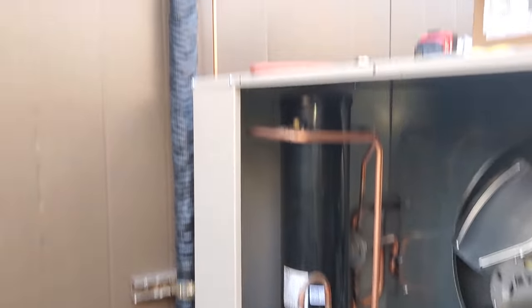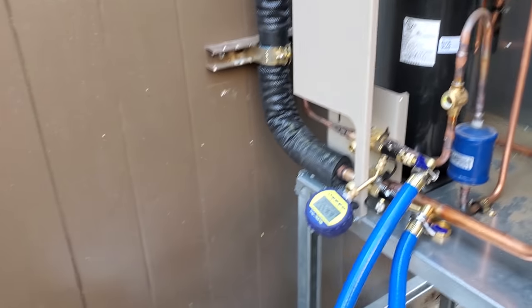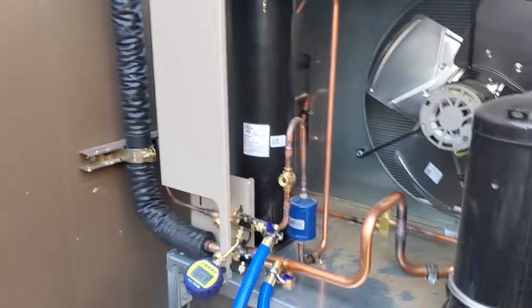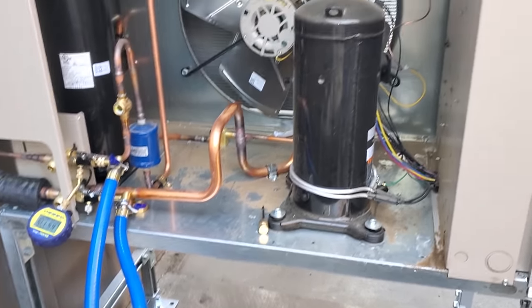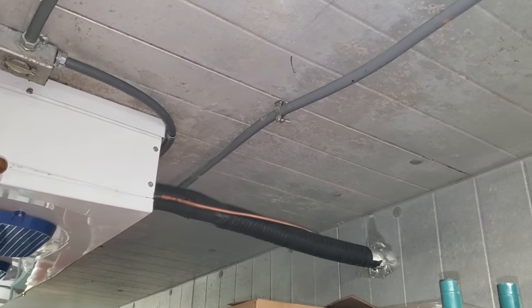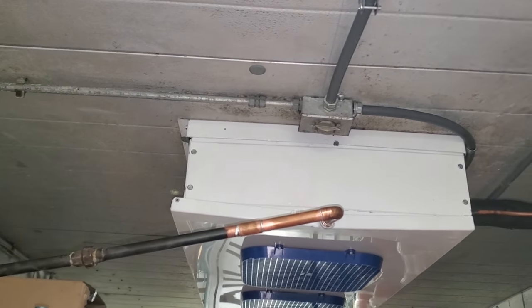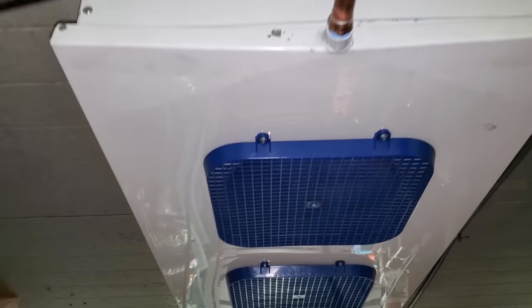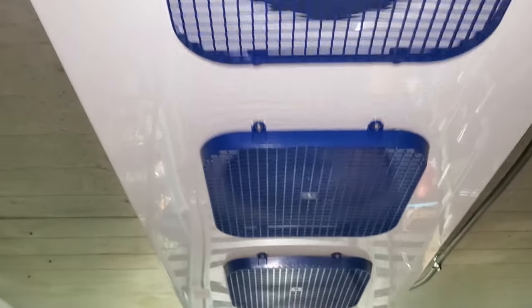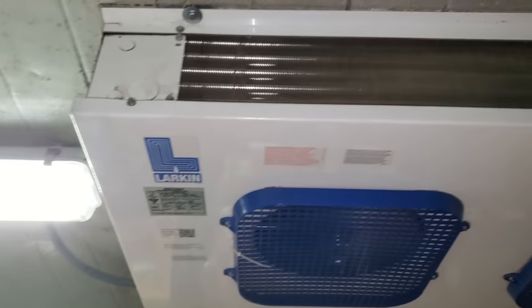We did a pressure test. We passed that. We got the vacuum pump on there. Lines are going inside — I'll take you guys inside and show you in a minute. We still got to tape up some stuff. Check phase rotation on the electrical and everything. We've got some temporary tape over there just to hold back the foam. The new coil is installed. It's running. We're getting ready to start it up right now. So we've got to trim up some foam from the old holes and stuff. But yeah, looking great so far.